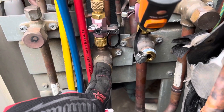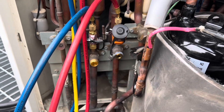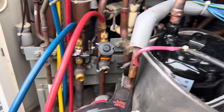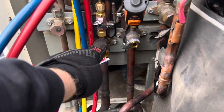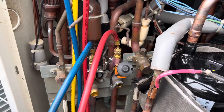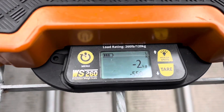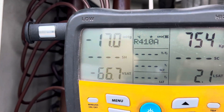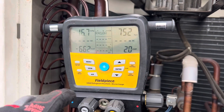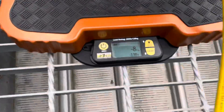I've closed off my suction port here and I'm going to force the refrigerant down the dual gas line - basically trying to force it the long way around before it comes back to the compressor. I don't know if that's going to make a difference but I'm hoping it will. I'll purge my lines and we'll get this thing charging. We're charging away. I think my plan's working - it's slowly starting to see my suction pressure rise, must be sending it the long way around. Almost through the first bottle.